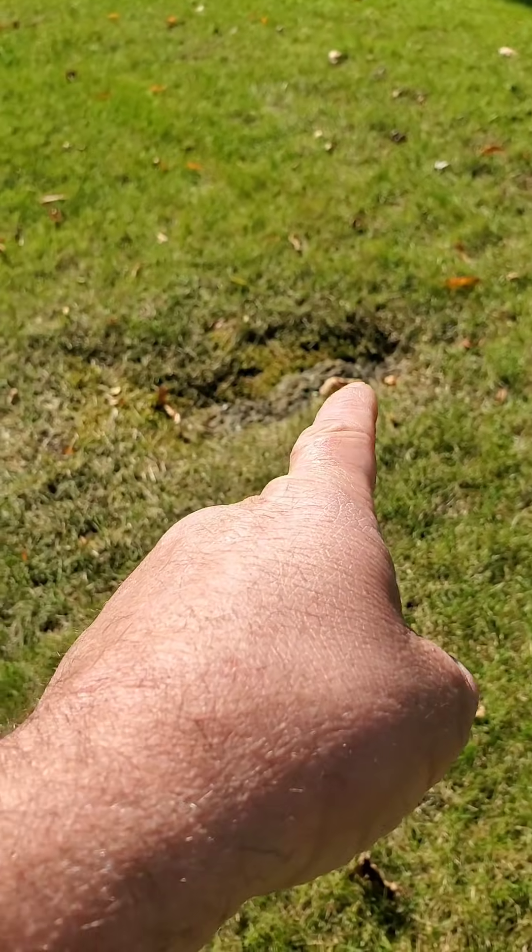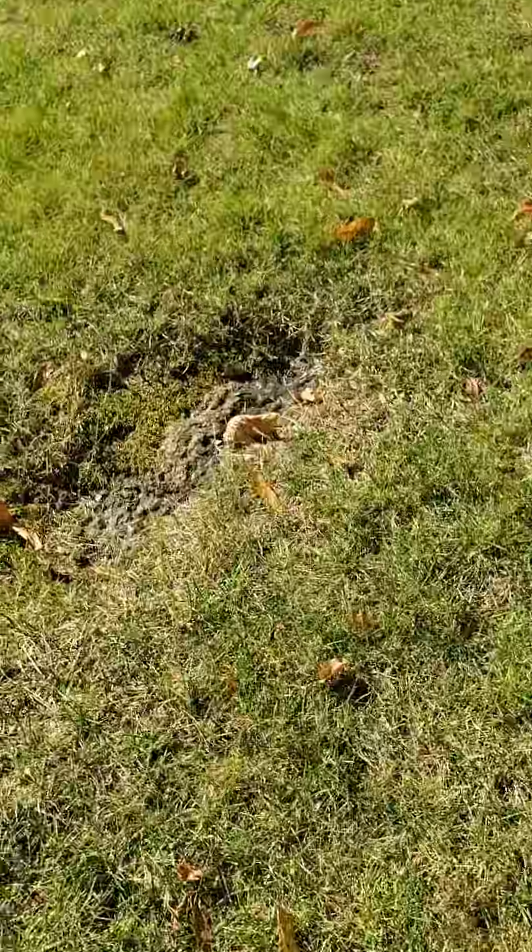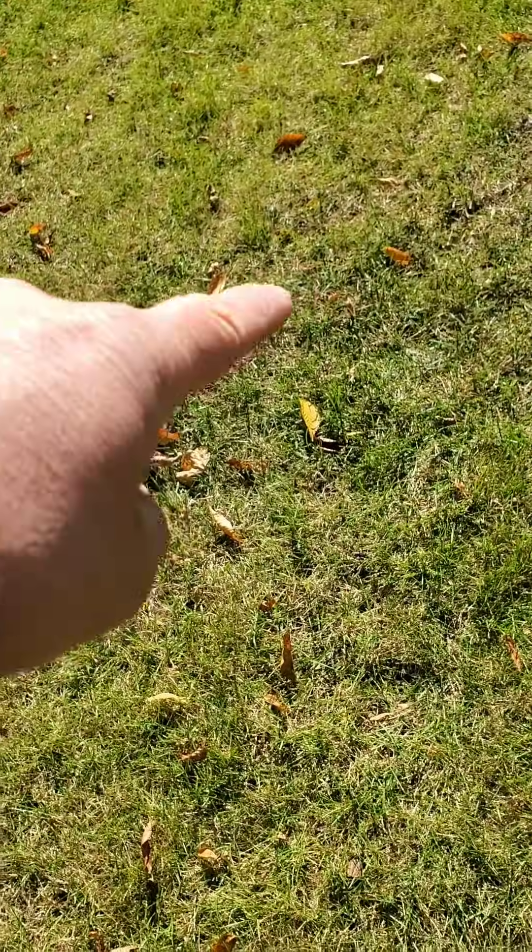She's having problems with water coming in when it rains hard and only when it rains hard — that told me whatever their drainage system was, it was clogging. This is where the French drains would probably drain out. I'm noticing some weird concrete and a circular patch — that's a big bunch of nope. This is why I always say: if you have surface water from the exterior coming into your basement, the best solution is never to trap it in the basement with a perimeter drain system and pump it back outside. Water does damage going through your foundation. If you don't believe water can cause that kind of damage, just ask the Grand Canyon.